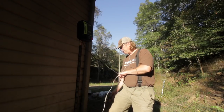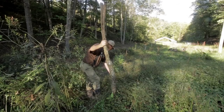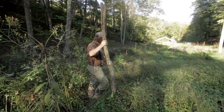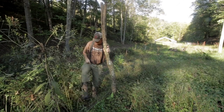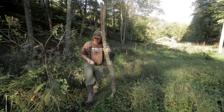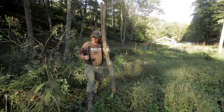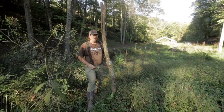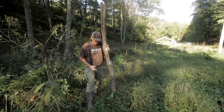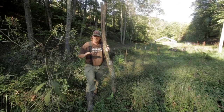There are a couple of quick tips to show you that make cleaning out your fence line pretty easy. You can see there's a lot of grass laying on this electric line and a branch laying there — it's definitely been neglected this moist season. If I just came through with a string trimmer and weed-ate underneath it, that would work fine, but you definitely want to unplug it first — you can electrify the shaft of your weed eater and still get a pretty good shock. Also, especially with 17-gauge wire, using a weed eater you can actually end up tearing up your wire, so you want to get the wire out of the way.